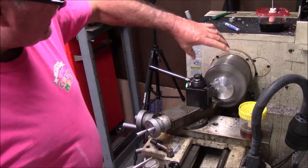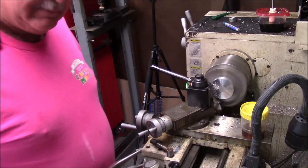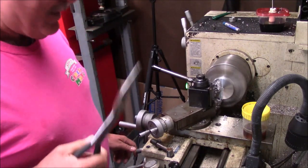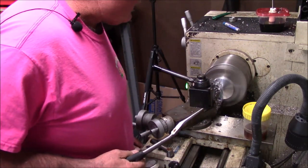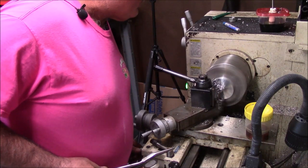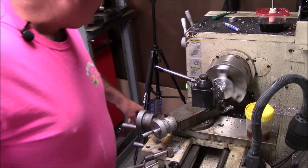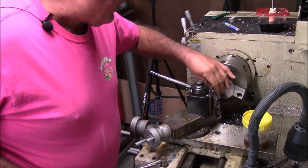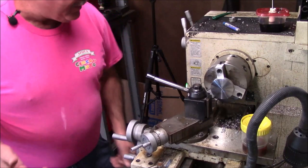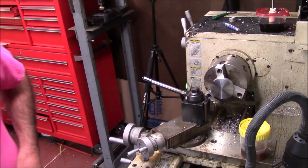When I set these up, I've got my jaws contained inside the part, and also to get better travel and grip - that's always something important to remember when you bore your soft jaws. I'm not chamfering them right now, there's not that much of a sharp edge on them. Now I've got a nice slick finish. I'm kind of doing this as a production job in stages, so now I'm going to go ahead and face the rest of these off.